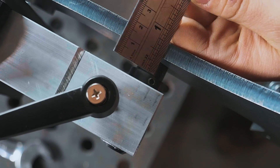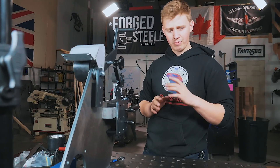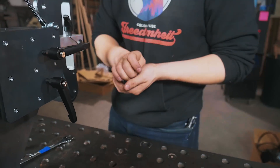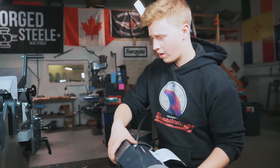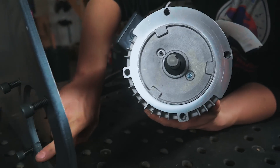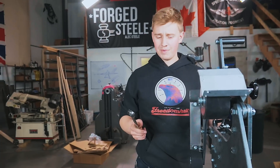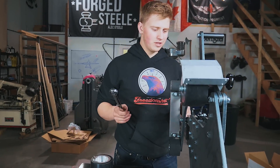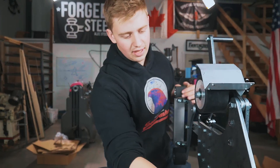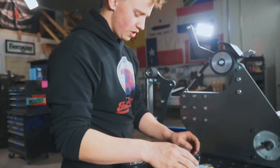We've completed the main body. The next step is attaching the motor, which is really simple — the motors come pre-wired. All we need are four 5/16-inch allen head screws; bolt them through here and get the motor up into position. On the face of the motor there's a ring around the outside that fits perfectly right inside the slot, then line up the four bolt holes in the motor with the four bolt holes in the frame. This can be a little challenging as a one-man operation, so use a shim in the back — anything about the right size — to keep the motor level as you get those bolts started. Then snug them up with the allen wrench.